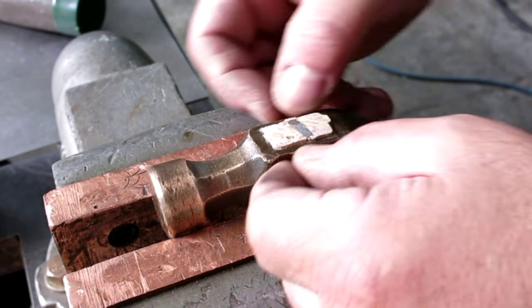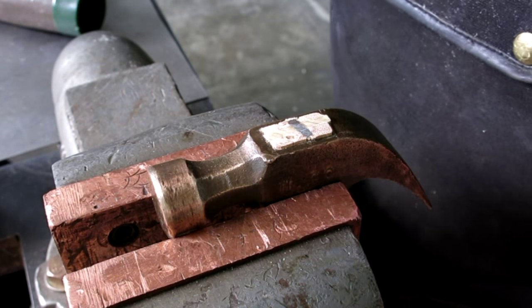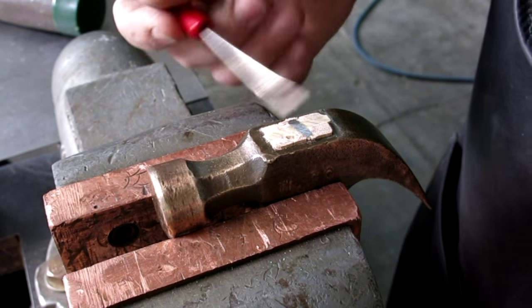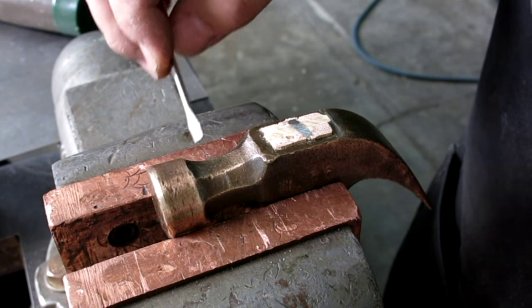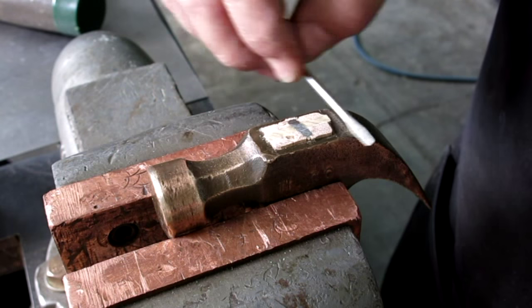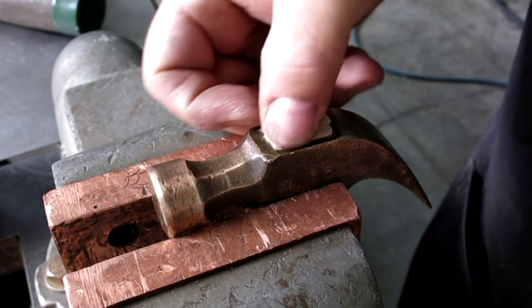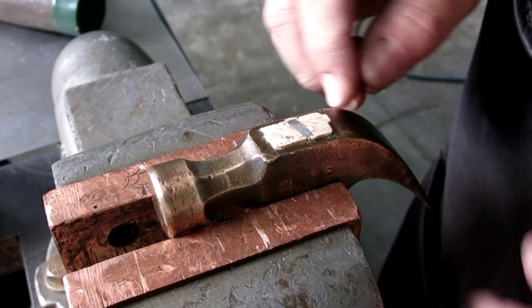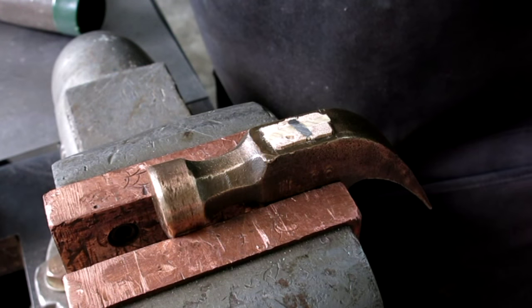Okay, so that's right off of the belt sander there. Pretty good. So the temptation is, if you have a hammer that you're not super worried about, you can go down and touch the metal and it's all nice and flush. But if you have one that has a nice patina on it like this and you don't want to monkey with it, better to leave a little bit sticking up than to go too far.